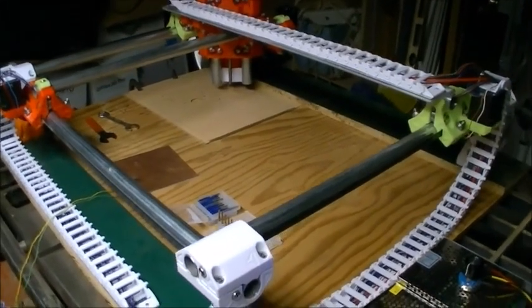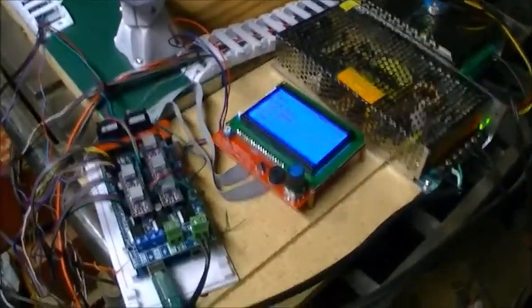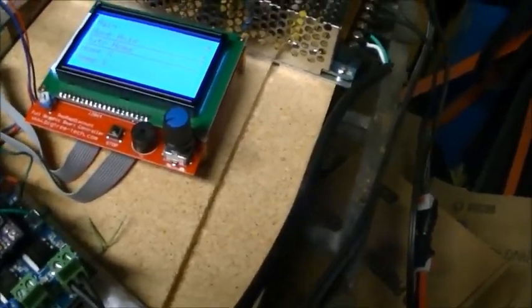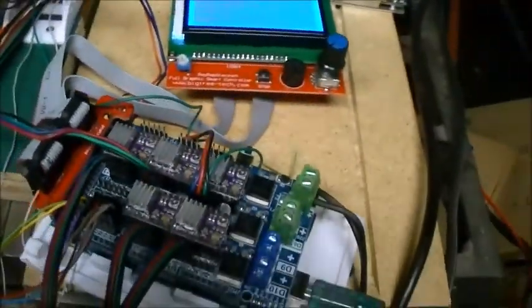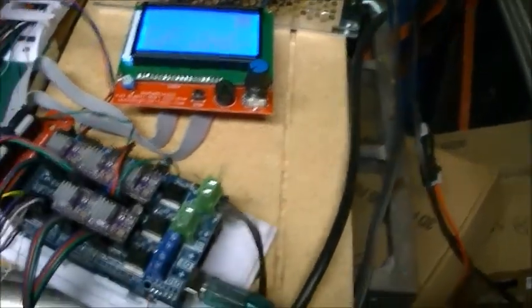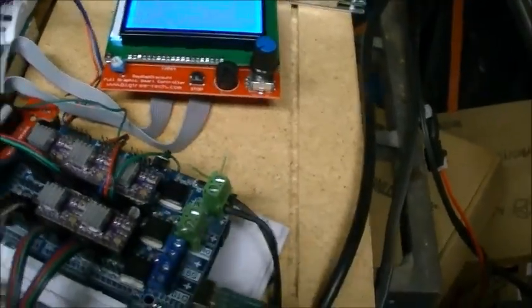First, I want to go over a few of the things that actually gave me issues. Simple things like the display. So there's a display, and the way it hooks up to the ramps board, there's actually a special, like the display is very standard for 3D printers. It's got an EXP1 and an EXP2 connector, but there aren't those connections on the ramps board.